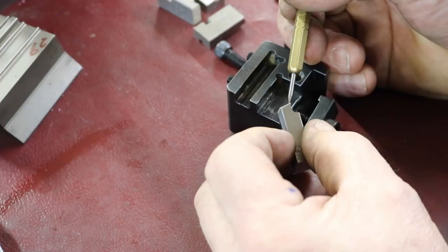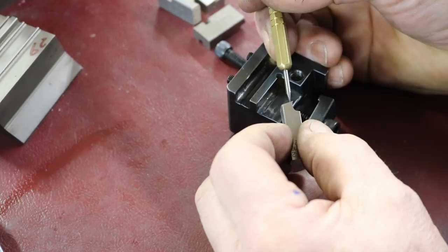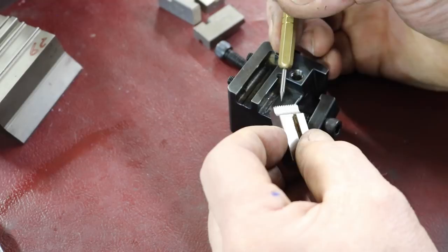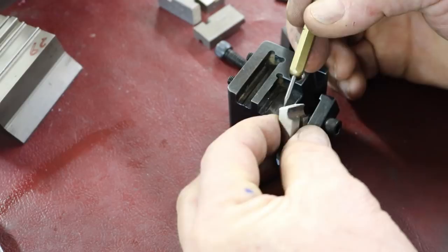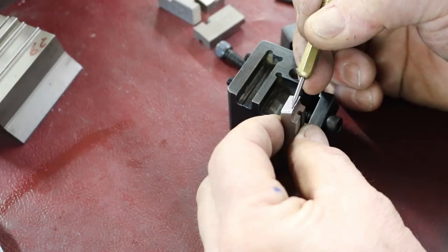And once it gets past here, you're going to have to play with your die head. You don't really have so much adjustment in your die head as far as how these cut, and they'll become useless to you, basically. You only grind here if you absolutely deem it necessary, and then you're only going to take off probably only in the tenths range, a few tenths. So I do have one set that are really worn, and looking at them in the microscope, right behind the cutting edge, they're really worn, and there's a divot in the thread form here.